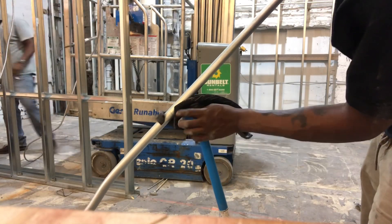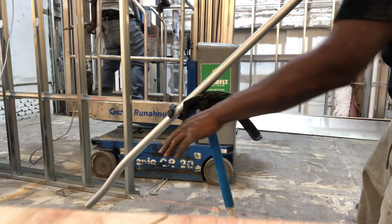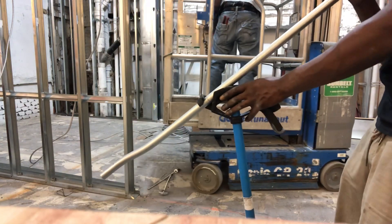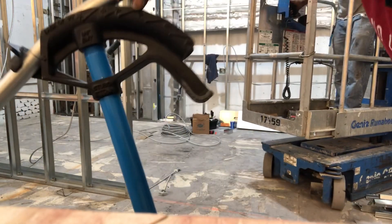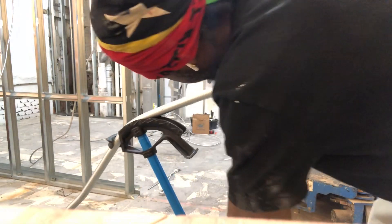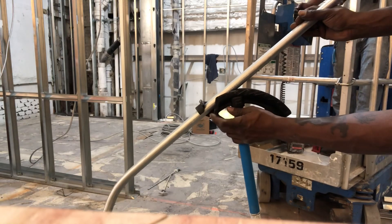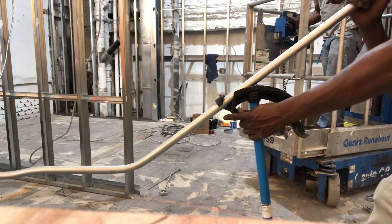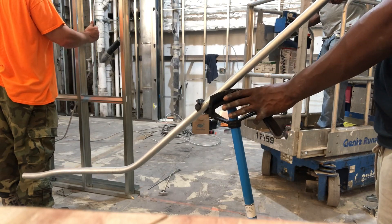We have our first mark right here at the arrow — that's the 16 that was away from here, 16 up. Always make sure you bend it the right way. It will be this way. Let's get our first 30 — we're using 30. It's the 30-degree bend. Alright, got our 30. Put our pipe in at our next mark, which is the 16 away. Flip the pipe the other way. Okay, we're straight.